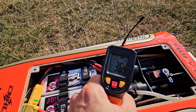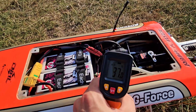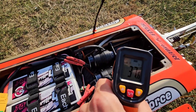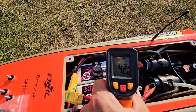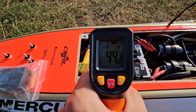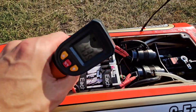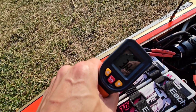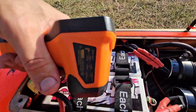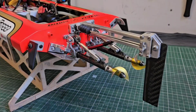Motor is about 37, 36. Other motor — same. That's a good sign, that means they take equal load. LiPo 42, 43 — other LiPo also. Connector 42, 43. Alright, not bad. Speed controller 37, other one 40, 40.